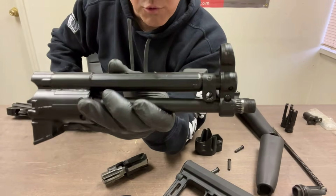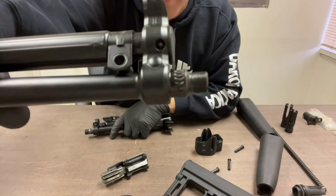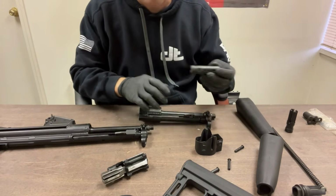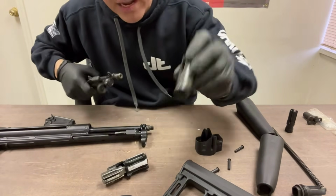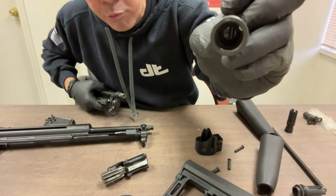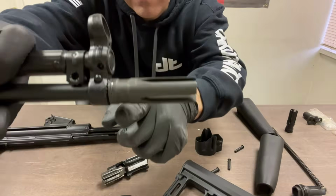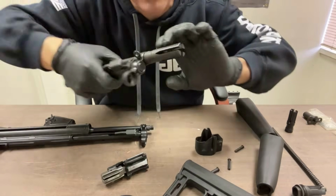So original German guns are metric M15x1 right hand, 1/2 by 28 with splines. So here's where a lot of confusion comes in. Metric muzzle devices are muzzle bottoming, which means the muzzle device squares up against the muzzle. There's actually a wall down inside there. The muzzle actually seats against that wall, and that is how metric muzzle devices square. It leaves a little bit of a gap, you can see there, between the front sight and the sight tower, because it's bottoming against the muzzle.